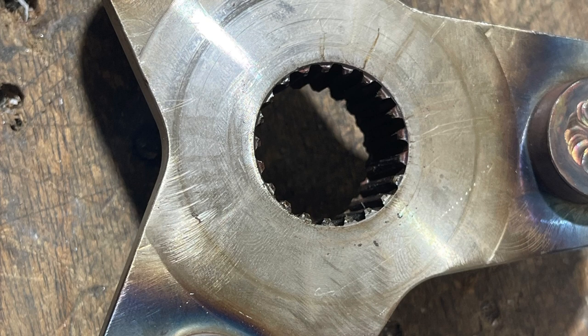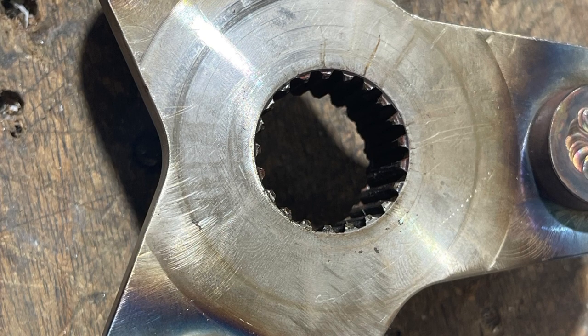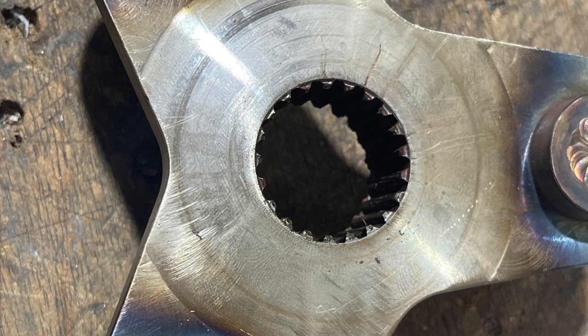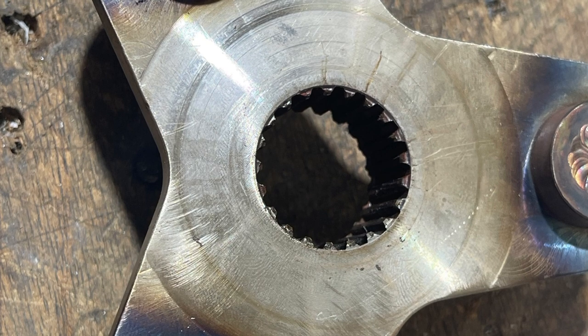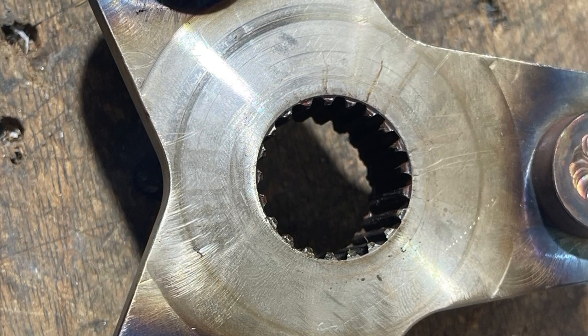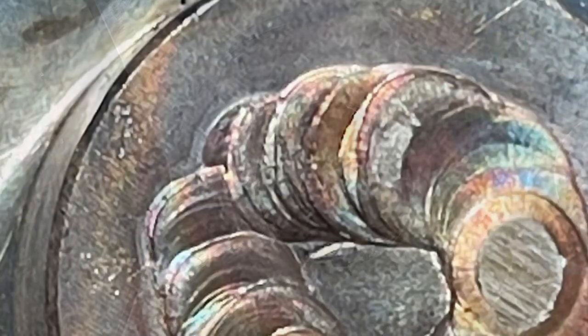Now, to install the snap ring we just showed, in order to keep the part further away, the gearbox has to be disassembled and the drive coupling pulled off and pressed back on with the snap ring. Since there's no approved procedure for any opening or work on the gearbox in the field, and since UPS and FedEx and other carriers can deliver a gearbox to Viking Aircraft Engines in a matter of a day or two from anywhere in the world, there's no need for any field work on this gearbox, nor is it approved. So if you think you don't have enough clearance in this area, the gearbox should be sent back to Viking for service to have this done.